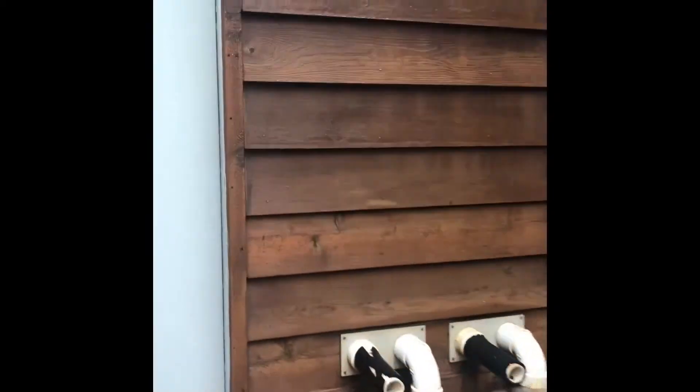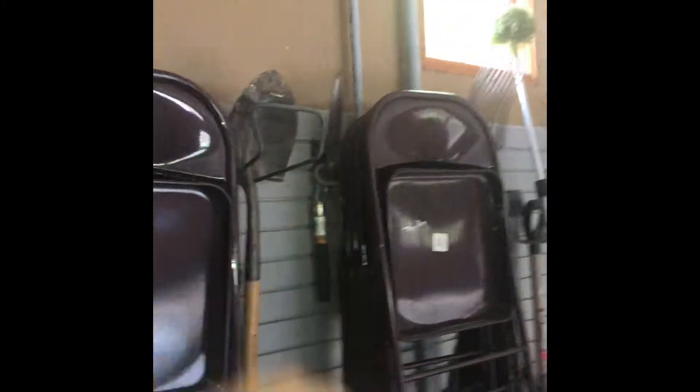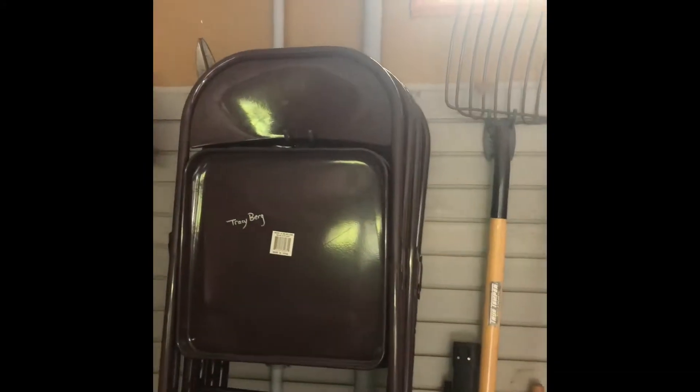Electrical is going to come from the basement and we'll come out in the garage right here in this area. From there I'm going to go up into the ceiling — not into it, but we'll use conduit just like they have here — and bring our electrical up and over and go straight to the outdoor unit, penetrating right here to go outside.